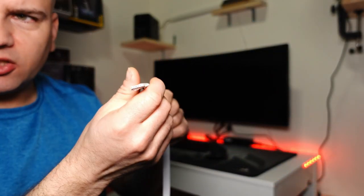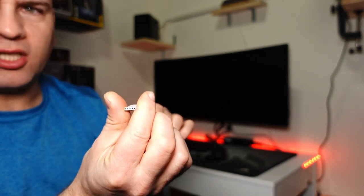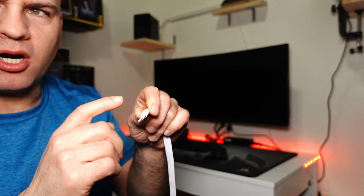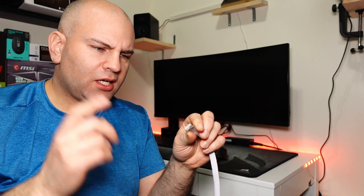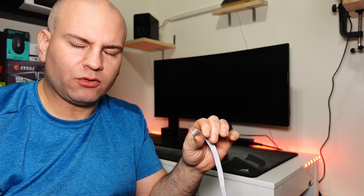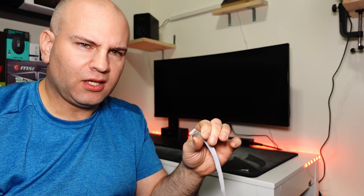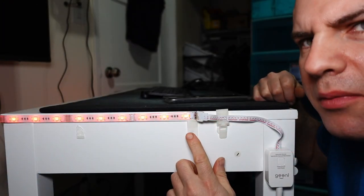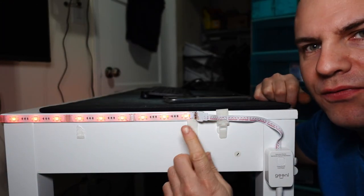Now here's the problem I'm about to show — I'm not sure if many people actually had this issue. Here's my experience: the connection here has pins where your controller connects to it, and it has this on both sides. Both times it didn't work properly. I got this from the store, took it home, connected the power right away on the reel itself — just for a moment it seemed okay, power's on, seems good. So I installed it and it was spotty — working and not working. The more I moved this connection, the less it worked, until it just did not work. It would flash for a split second and I couldn't leave it working. You may be able to see here it doesn't look like a proper connection — and in fact it wasn't.